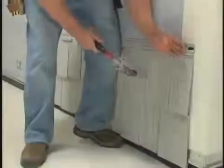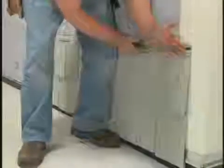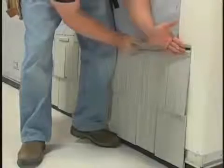Fasten the panel to the wall by nailing through the center hole of the nailing hem at the top of the panel. This will control the direction of expansion and contraction. Continue nailing the panel with 5 nails, 1 in the right end nail slot and 1 in each of the quick reference nail mark indicators. Drive nails straight, not angled, into solid wood or nailable substrate. Leave an 1/8 of an inch to a 1/16 of an inch between the nail heads and the panel to allow for freedom of movement during expansion and contraction of the panel.